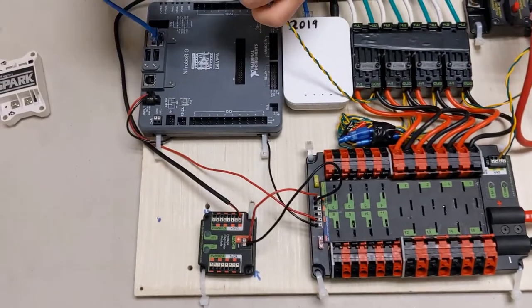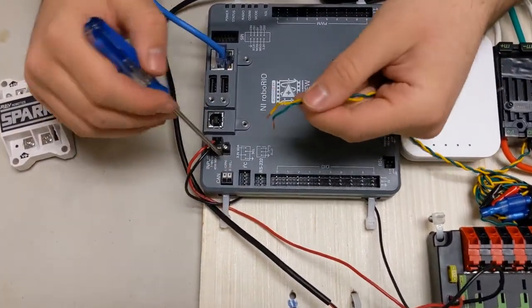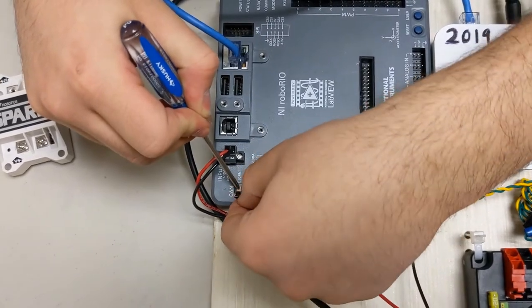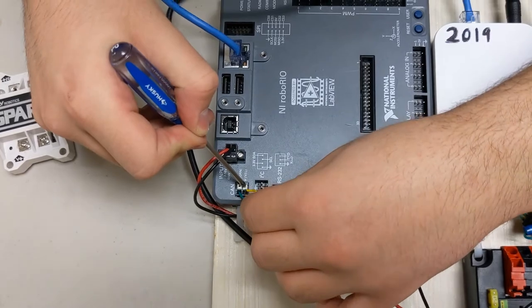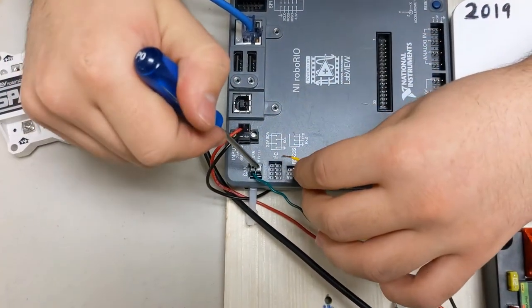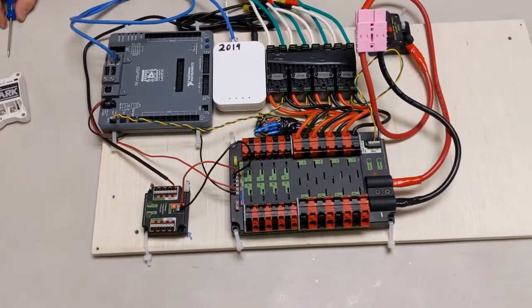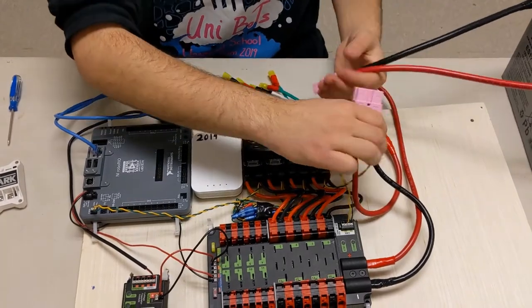Now we need to complete the loop by putting the other ones into the CAN bus. Now you can see L is green and H is yellow. So green and yellow. The wire is frayed, and that's not good. So twist it, put the wires back in. There we go. Now all our components are wired up, and we can attach it to power once again,